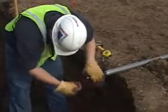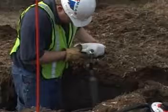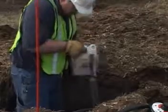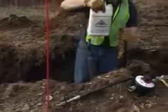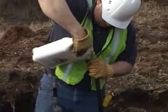Wipe the tool fittings down with a clean cloth. When operating a piercing tool for the first time, or after a long storage period, pre-lube the tool with ½ ounce of Hammerhead mole oil. Pre-lube the tool supply hose with 3 to 5 ounces.